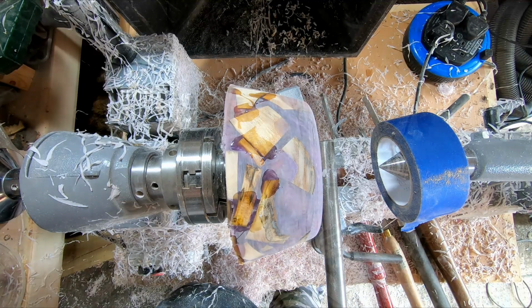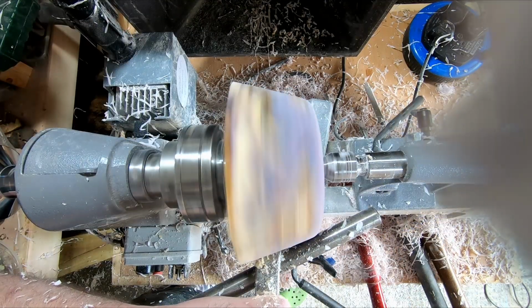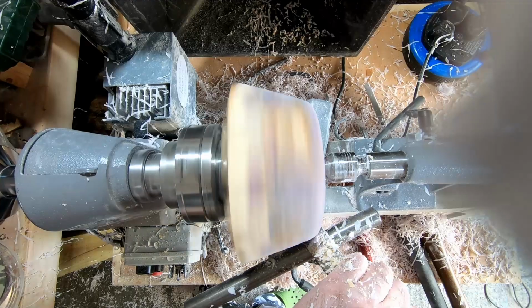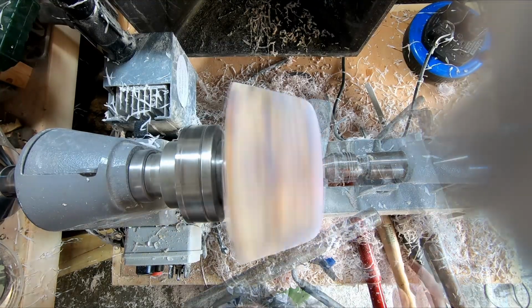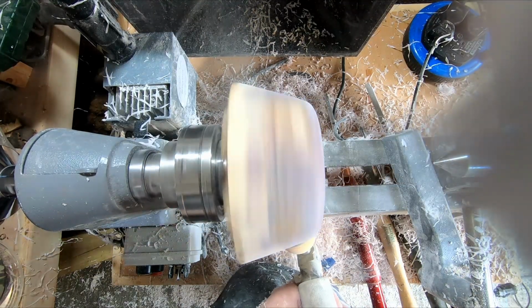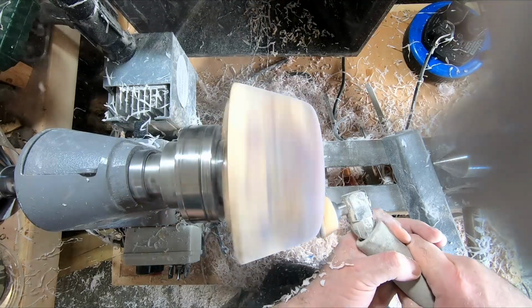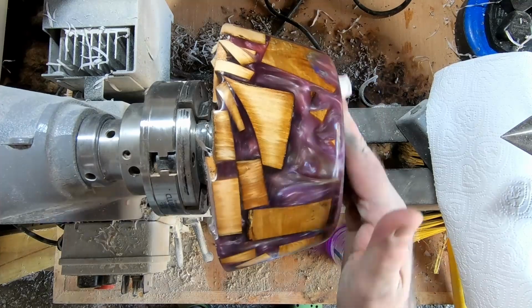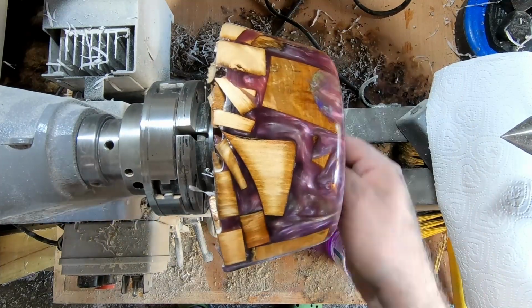It took about 10 minutes for the epoxy to cure, then I could use the skew chisel to gently scrape away the excess, which left a more or less invisible repair. Then it was time for sanding from 80 to 3000 grit, followed by a good clean with denatured alcohol, then a single application of sanding sealer.